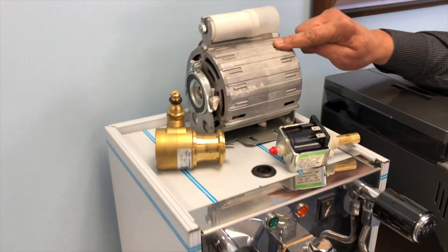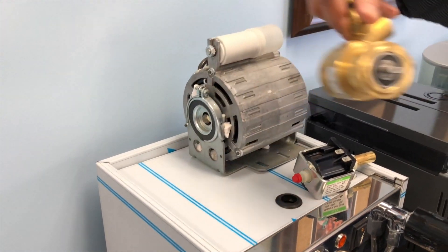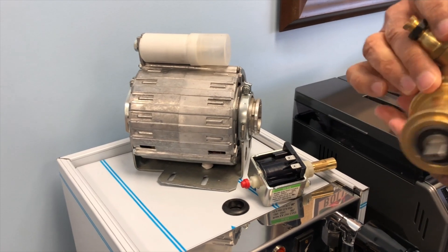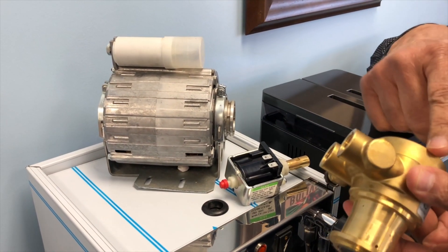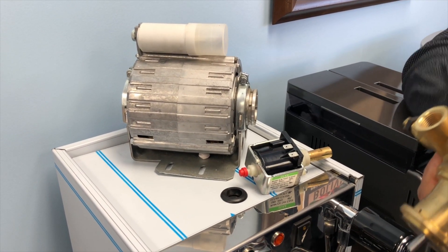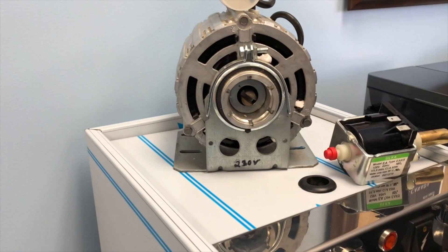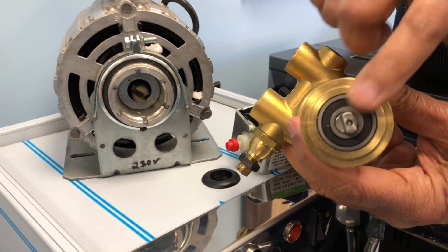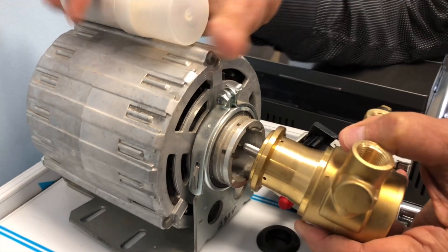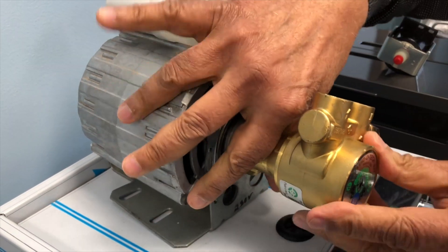I have here the pump motor that is necessary to operate the rotary pump. The rotary pump cannot operate itself, and if it is operating and it is quiet, it is because there is nothing in it except a vane that is attached to a rotor. That rotor has to be turned by a motor. This is the motor — there is a slot here that will engage the flat tab from the rotary pump, and this locks in so that the motor can turn the rotary pump, with a clamp here to hold these together.